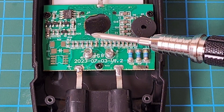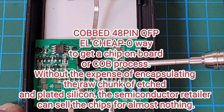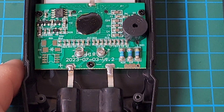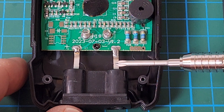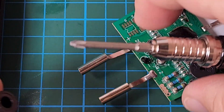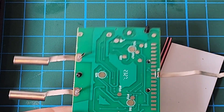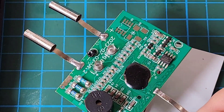That main package is cobbed, as per the norm. There's a little 24C02 EEPROM over here, there's the speaker, and not much going on as you can see. Springs for the battery terminals. I don't see any PTCs or MOVs whatsoever — perhaps a diode clamp over here, but not much to speak of. The jacks are the split variety, soldered on. On the other side: nothing — no other forms of input protection. That is literally the tiniest multimeter PCB I have ever seen.